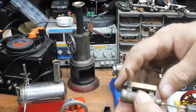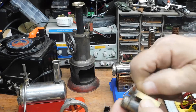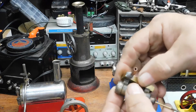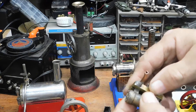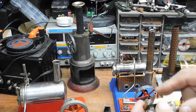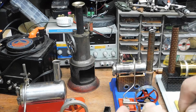The seal is kept between these two by spring tension. As this nut is tightened, it ensures that this stays together and the steam doesn't leak out. But what that also does is cause friction. So these are very inexpensive to make and the simplest design, but they're limited on the amount of power they can generate because there's a constant friction.